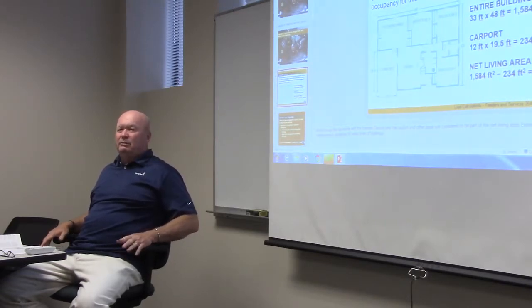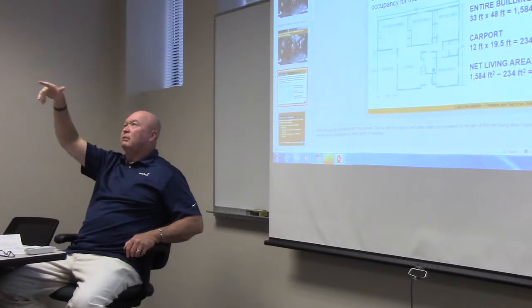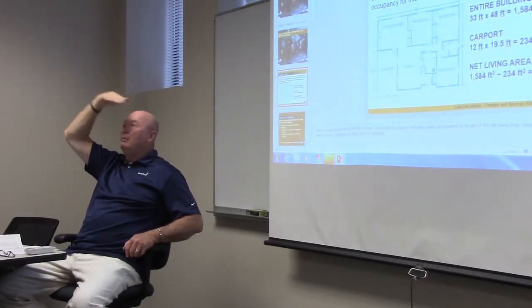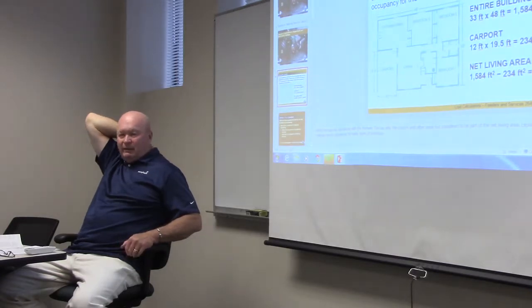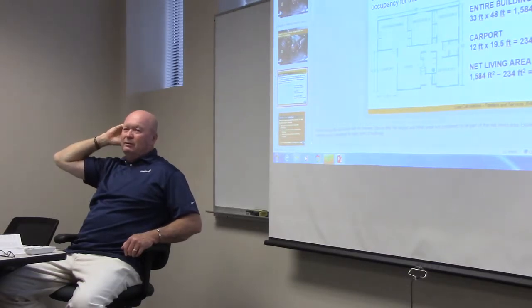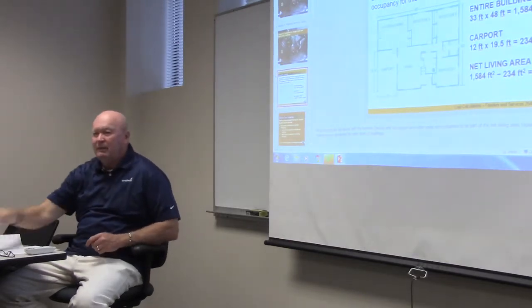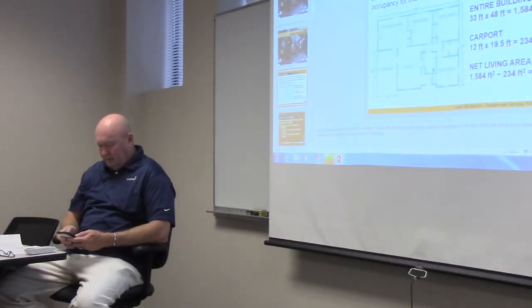Because that happens, particularly on a two-story building, let's say you're on the first story with a 10-foot ceiling. What would you do as far as tying off? I'm going to ask that to our safety guy. The only thing I can think you practically could do is take a rope and loop around a bar joist. But if it's a concrete slab, you don't have a bar joist up there.